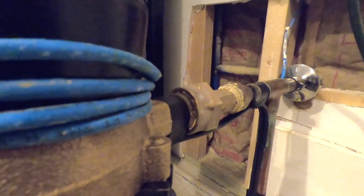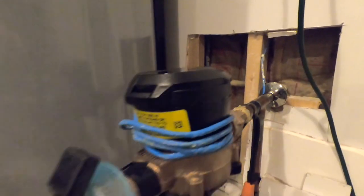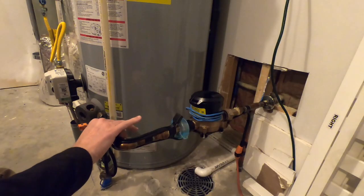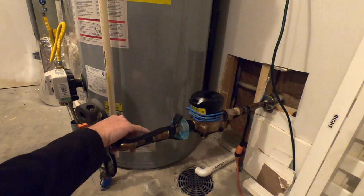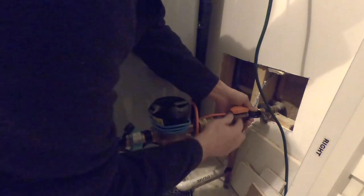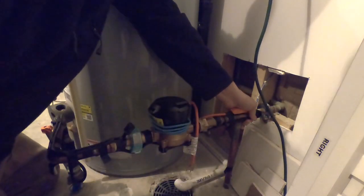All right. All that's left now is to go ahead and just tighten this up a bit — take up some of the gaps so the heat tape is touching the pipe as often as possible. I decided to move the thermostat up to the top here, because water just sits in this pipe — it's a supply pipe but water will run in it — so that'll be better.